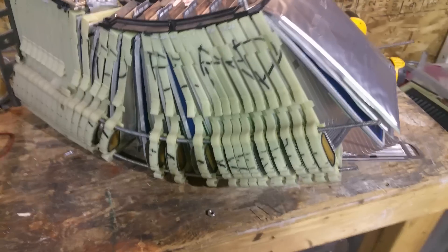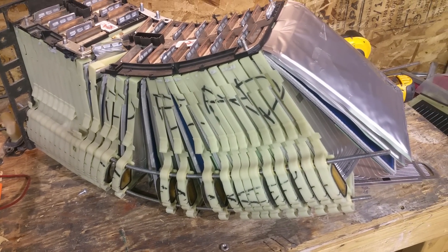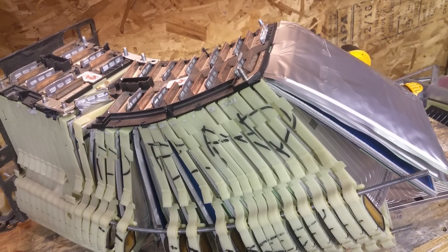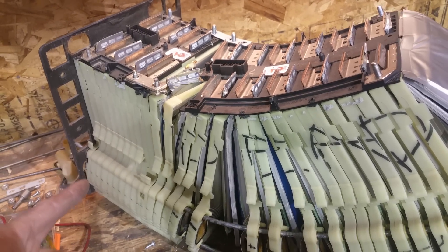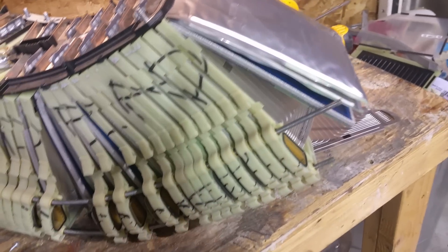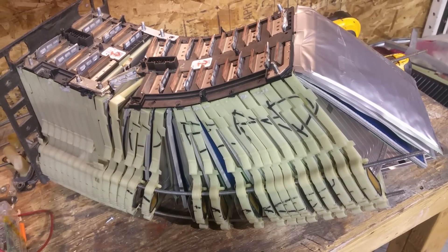I'm going to continue carefully taking this apart. I'll have to find a place to properly recycle this — I've got a decent stockpile of bad batteries that need to get recycled. Not a fault of the battery itself — the BMS board on top failed and drained this and one other module down to zero volts; the other didn't go to zero but this one drained all the way. You have to be careful because if you put enough pressure it can actually damage the adjacent module that still has energy in it, causing a cascade fault — not a good day. The worst condition is when you overcharge and then have a fault — that's a really, really bad day.